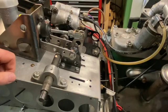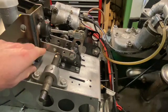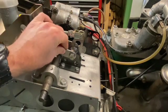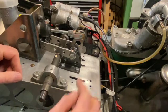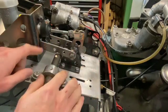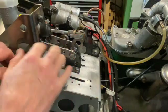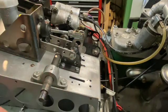There's the bracket. I decided to go more direct to the bottom fixing rather than the top fixing. I'm quite happy with it — it's a nice sturdy thing, 3mm thick. If I'm pushing against that, this bracket is opposing that push. Without it I'd probably see some flex in the base plate. I don't know that for a fact but my gut feel is that I would. So this bracket opposes that force and effectively takes the base plate out of the equation. That's all good.